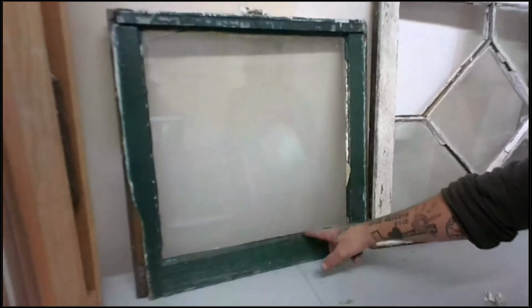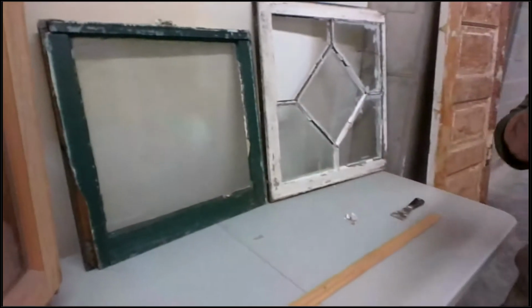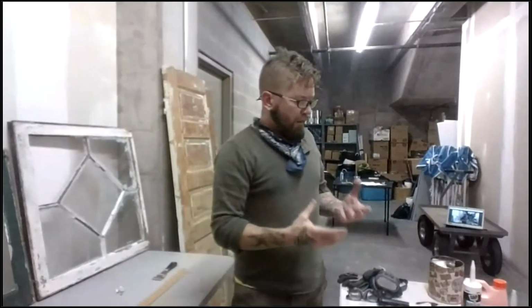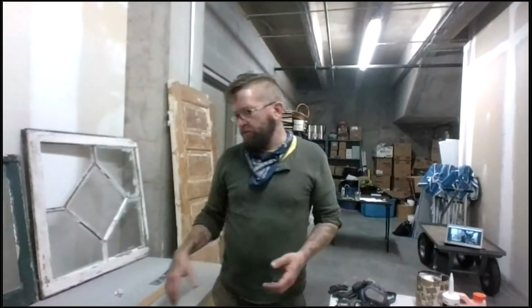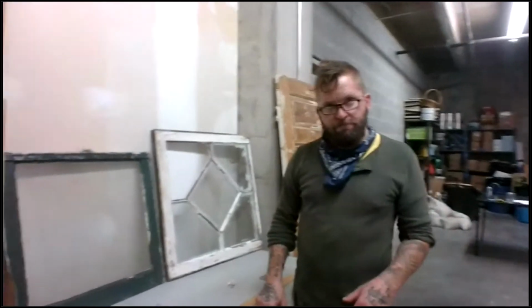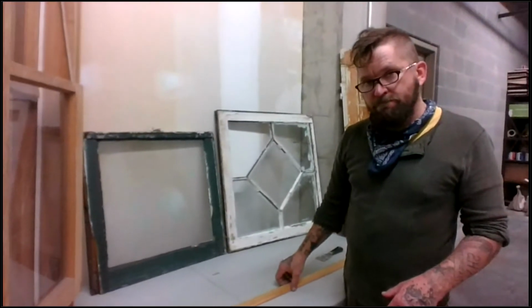not just a little spot, because anywhere there are two different materials going up against each other, old and new, there's the potential for water to get in there. Even though glazing doesn't really expand and contract with temperature, if water gets in a small crack, water expands. Obviously, ice will get cold and push the glazing and crack it between the old and new material. So, could we use this time to talk a little bit about hardware on the window?